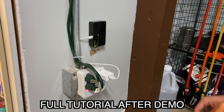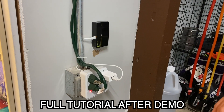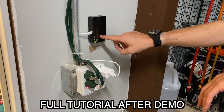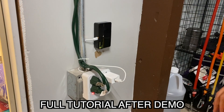On location here with no Wi-Fi, no internet access. The central gateway is here in this nice little enclosure. So we've got an ESP32 access point, all trig boards communicating back to this, passing over to the 4G LTE particle boron module, and then out to the cloud.